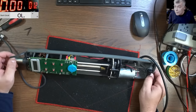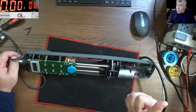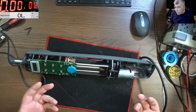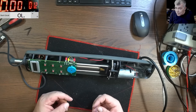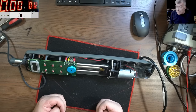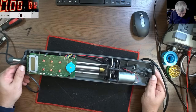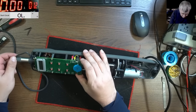So you have to find that chip which is reading the power button. That chip must be under power, yeah? Basically, if that chip has power and the power button has voltage and is already in the power button, then it's a big problem, okay? But most of the time, that chip doesn't have power, okay? So, not sure what we can do here. I will say, let's take out this board. Let's have a look.